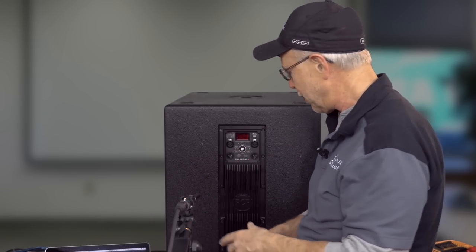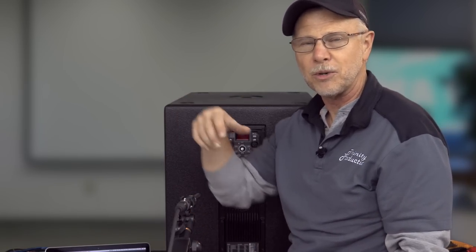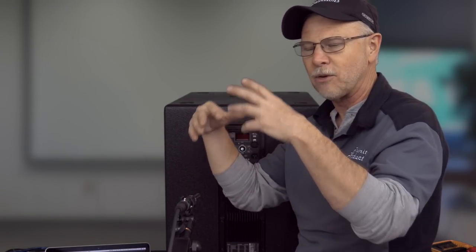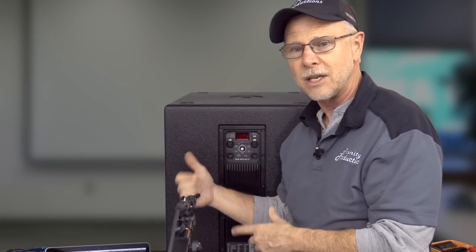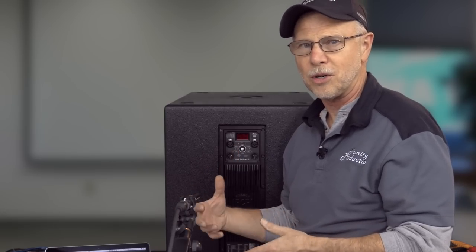And it's going to take everything from where you set that preset at 80 or 100 or 120 and shove it up to your top box, so that you're not trying to push through another 15 inch driver or a 12 inch driver or a 10 or an 8 or whatever. When you're using these things, you're not trying to push all that energy and send it into limiting prematurely.